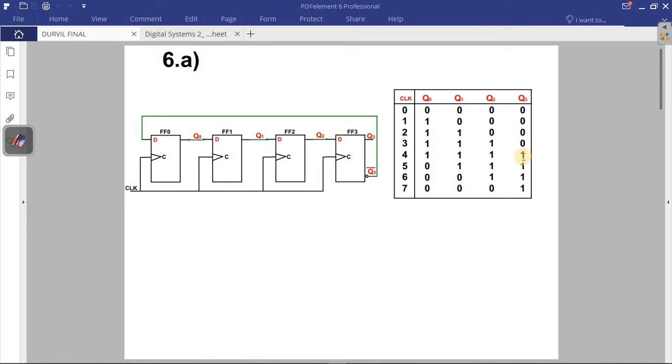After clock four, we're still in the first cycle. We start shifting again, but now we fill with zeros. You fill with zero until you have zero zero everywhere in every Q output, and the last one still has a one. That's where the cycle stops. You can see it's quite easy.